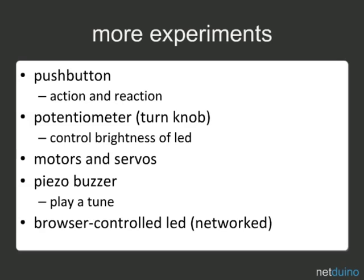In fact, motors and servos, that's another thing we cover. And the book doesn't go into motors in a lot of detail because motors are pretty simple. You use what's called the PWM feature, and you say, I want this to run at 0% speed or 100% speed or whatever percent in between. It's not that difficult. You use some external componentry, often built into one of what's called an expansion shield that plugs in on top that takes your PWM signal, combines it with a bunch of power, and turns it into an analog voltage, which can drive the motor at a respective speed.